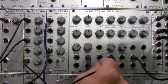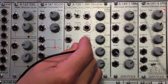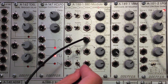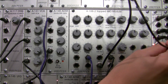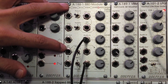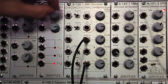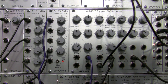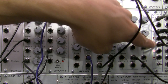I'm going to take the 1726 and go straight up to the top section into my A188-1, and I'm going to take the output of that and go into number two. Now I'm going to go back up to my A188-1 so I can tweak what I want that second signal to sound like. That's different enough that I kind of like it. So input one is the BBD output coming from the A188-2, and input two is a sound coming from the A188-1.